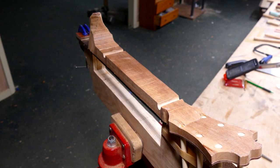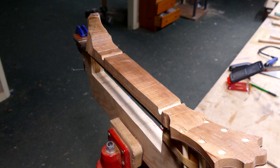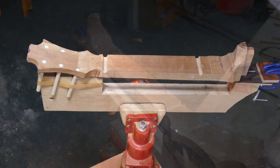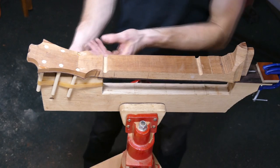Also keep in mind that the actual thickness of my neck in the very end, when the guitar is complete, will be closer to 22 millimeters at the nut and 24 millimeters at the heel. This is because, as you may recall, the fretboard is still unradiused and oversized. So we will not reach the true thickness until a later lesson when we radius and level the fretboard. All of my parameters are set and I'm ready to carve.